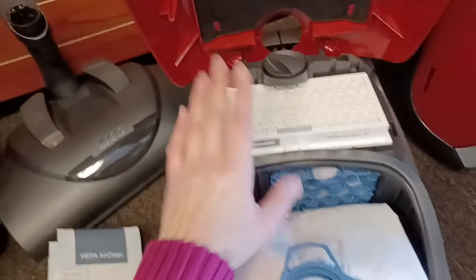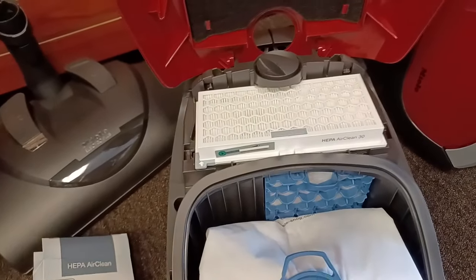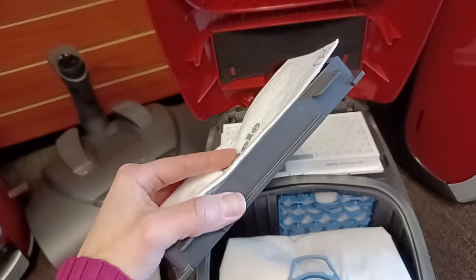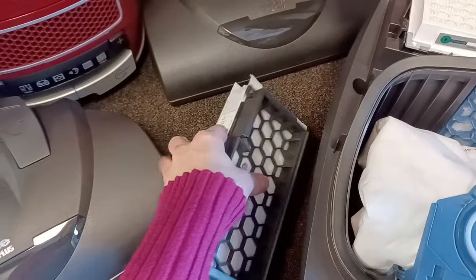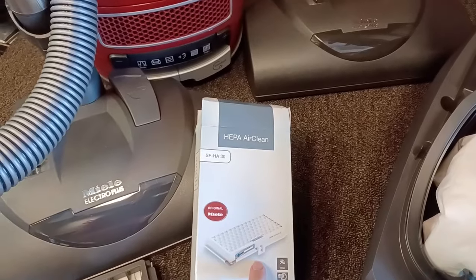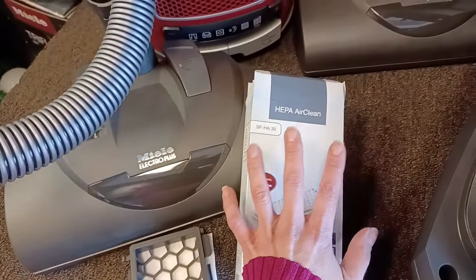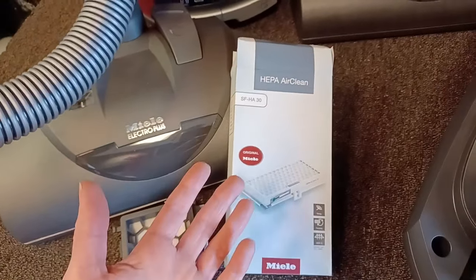If this is the machine you have, make sure your HEPA filter is installed, pushed down and snapped in all the way, dated, and activated. As for the cage — what I like to do is save it. Band it together and save it in your old HEPA box, but cross that out because it's not a HEPA anymore, and write 'filter downgrade cage' in big permanent marker so you know what it is.